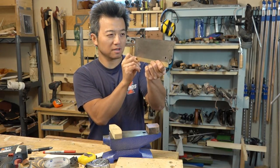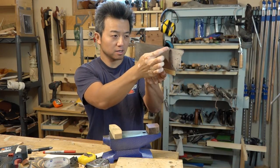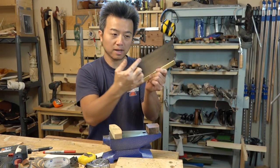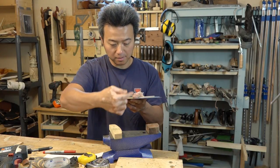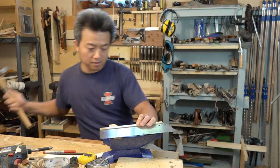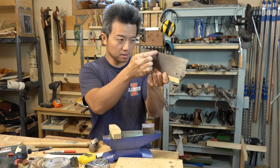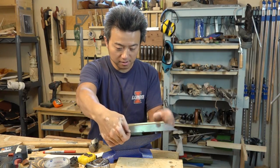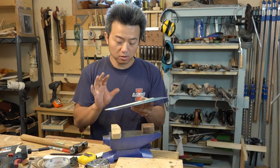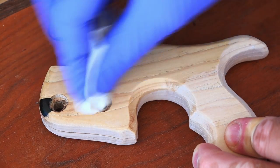This saw itself is actually pretty straight already, but if it wasn't straight I would look and find where the curve is. There's a little bit of curve here — it's cupped this way — so I'm going to put the spine on here and give it a firm whack, not too hard, just firm. This thing is super dead straight right now. Gradually, a little bit at a time, you can get the saw to bend and get the plate nice and straight.